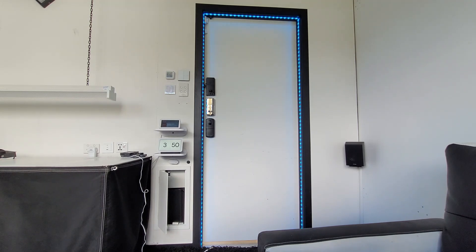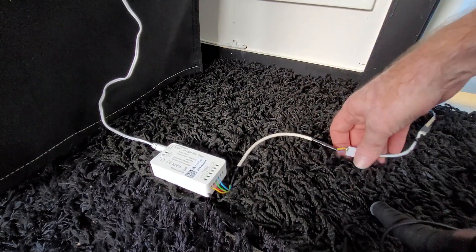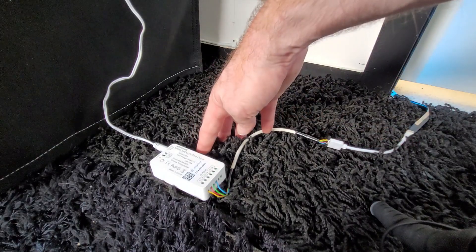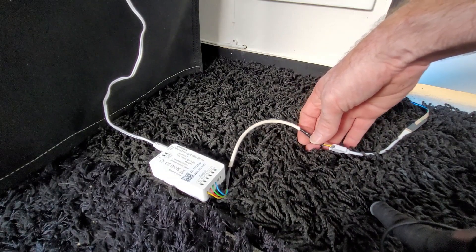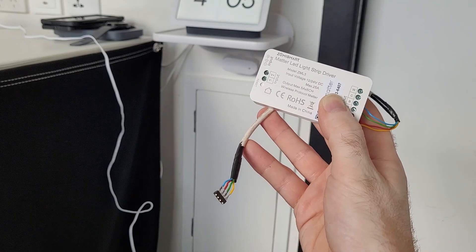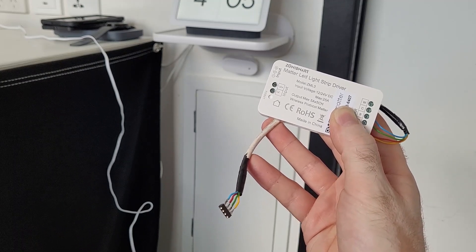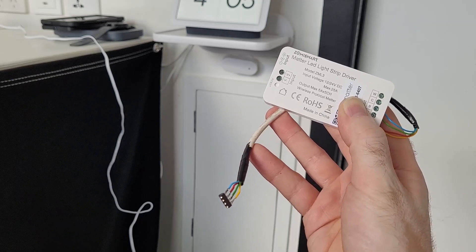That's how the Zemismart Matter LED light strip driver works — and those are just some examples of how you can use it. It's a really great device that works incredibly well, and setting it up is not at all difficult. Once you have the adapter cable made up to connect the LED strip to the controller, it's really easy to set up and use. If making the adapter is too technical, you could just chop the plug off your LED strip and connect directly to the device, which is faster. An adapter cable does not have to be made if you don't want to. If you want one, there's a link in the description to Zemismart's website, and you can also ask them to add an LED strip to your order. I would recommend buying the 6-pin LED strip as you can do more with it than a standard 4-pin.